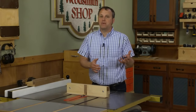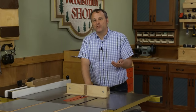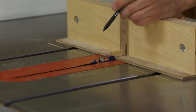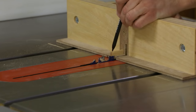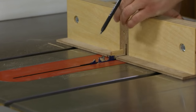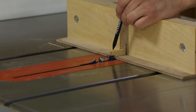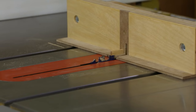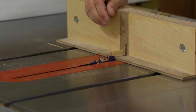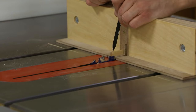When you go to make up your box joint jig and start making parts, the first thing to do is set up the dado blade at the sizing you're looking for. Here I'm using the two scoring blades on this set to create a quarter-inch wide dado. From there, I'll size a hardwood blank to match that thickness — cut a dado on the end of a piece, then rip some small strips that fit in there nice and snug. You don't want anything too tight, because as you step along the last thing you want is to have to pound it onto your key.